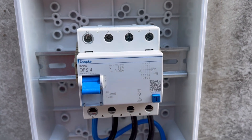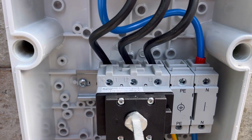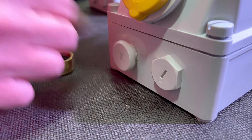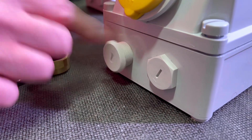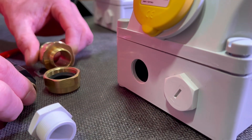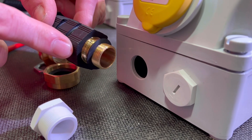Rick's exhausted the battery on the pressure washer. Let's have a look under the cover to see if that IP rating stacks up. One of the great features we like about this product is the pre-drilled and capped cable entry. In this version we've got three, but they're all threaded, so they're ideal for bringing SWA glands straight in. Just one top tip: remember to check the IP rating of the gland and that all-important O-ring seal.